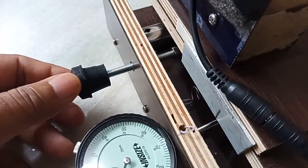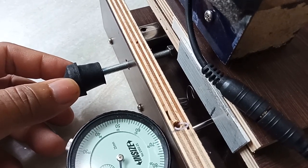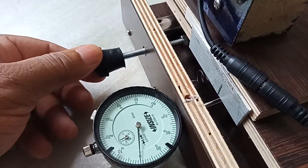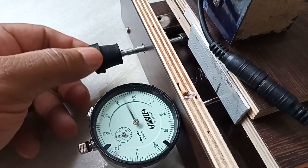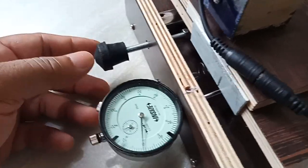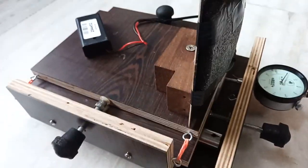This time I have used a 6mm, 25 threads-per-inch bolt, which will basically match with this one, so one entire turn will be 1mm. You can see here — this is another addition to the tester.